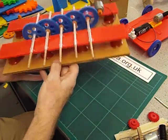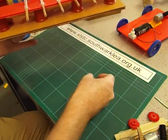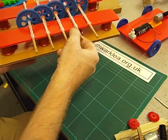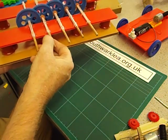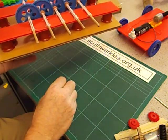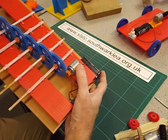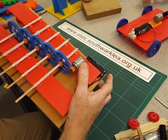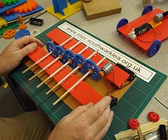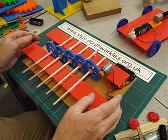Another way of looking at this: imagine you had string wrapped around an axle that was lifting a weight from the ground. You'd probably be able to lift a few hundred grams with that axle, but once we get down to here you could probably lift several kilos — still originally from this very small, not very powerful motor. So that's the magic of gears really: using them in combinations you can make machines and mechanisms to do things beyond our own strength.